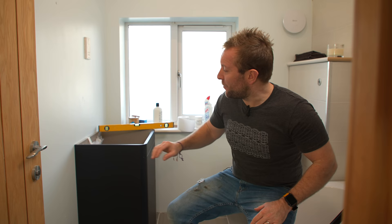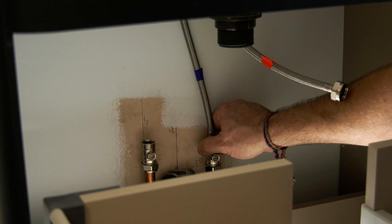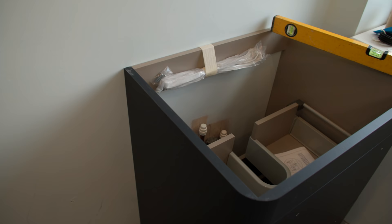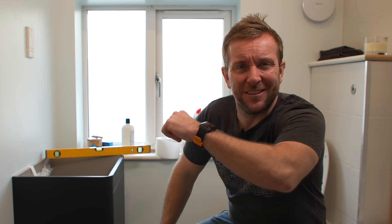Welcome back to the channel. My name's James. Today what we're going to be doing is really fun — a bit of work. We're going to be getting our basin installed, the vanity unit in. We're going to be doing the inch and a quarter waste and the hot and cold 15 millimeter copper feeds. I'm going to show you how to do the basin waste and at the end it should look absolutely beautiful. Remember all the tools I use in this video you can find in our Amazon store links below. You can also follow us on Reddit and TikTok. Anyway, let's get on with the video and remember to hold tight.